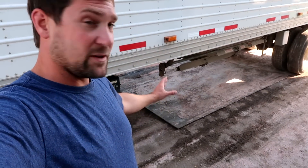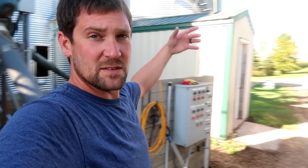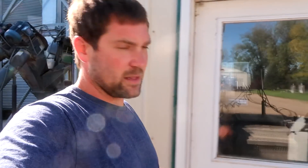Now what we're going to do - which is much less fun than that - is climb into the bin where we ran some corn last night. After we were done pumping the pits out, there's always a couple gallons of water at the bottom we can't get to. The way we get that out is to run two or three bushels of corn through there, and that corn carries the water up into the grain leg and into the wet bin. Then we hop in the wet bin, spread that corn out, and the water filters through the perforations in the floor. We turn the fan on overnight to dry it all up. So the grain is dry now - we're going to go in there and shovel that up, clean the floor, and blend it off with a normal load going to town.